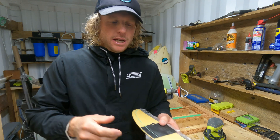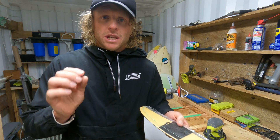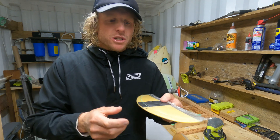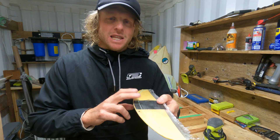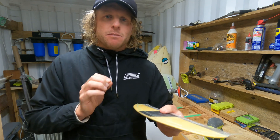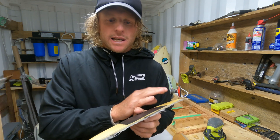When we paint on the resin, that is kind of the finished surface, but don't expect too much from the filler coat. When I was learning, I thought the filler coat would give me more thickness, but it doesn't. So we want to get this really close to exactly the shape we want — knocking out all those highs, blending in any areas that need blending without burning through the fiberglass. Just be mindful you're not sanding too much, but at the same time get this to a nice finish.